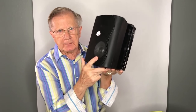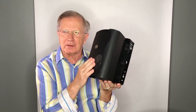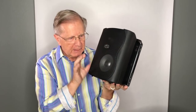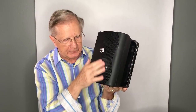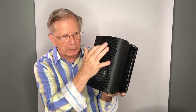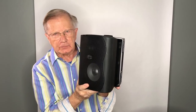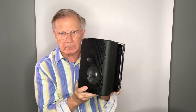The speaker itself is very important. I was a student, so to speak, of Paul Klipsch — he was a great mentor to me. He taught me about speakers and cavities, tuning the speaker to the cavity, and that's what's happened here. It's a 5-inch speaker in a tuned cavity with a 3½-inch tweeter. That really punches the 2.5k — the so-important mids — so you can understand the difference of an F and an S, a P or a B.